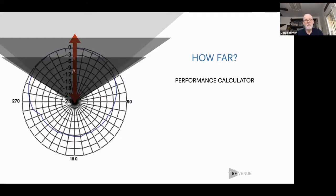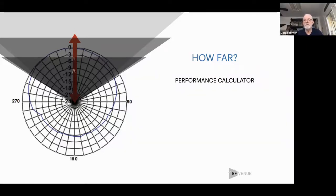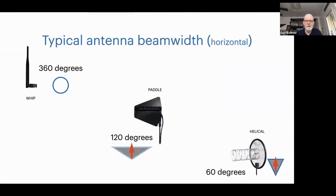I'm showing you a triangle to represent coverage, but I'm not implying it stops at the end of that triangle — it just keeps going. How far it goes, the performance calculator will tell you. The same antenna has different ranges depending on where you are. If you're out in the middle of nowhere on top of a mountain in Idaho, you're going to get a different answer than if you're in downtown Manhattan, even though the electronics don't change.